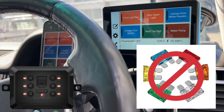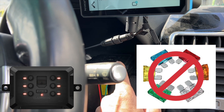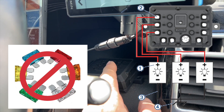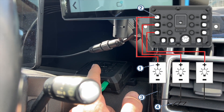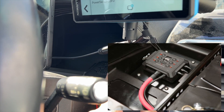Now for the do-it-yourselfer there's a huge advantage to this power switch: no fuses are needed. It's all digital technology, all MOSFET control — that means no fuses at all. Just wire straight in here, the negative goes to the battery negative, just the positives are wired in on the edge, and hey presto, it's all done and dusted.